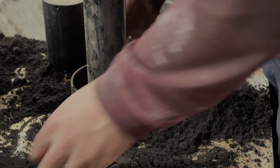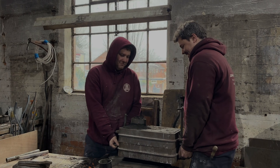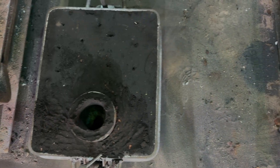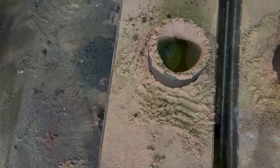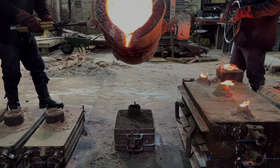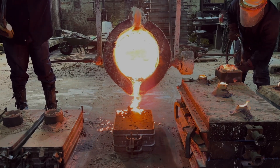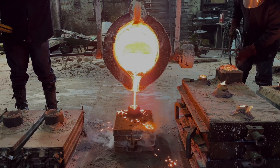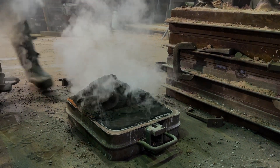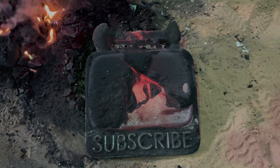It's time for the final touches. Ant creates a bush out of green sand which helps guide the metal into the runner bar, and the mould is brought to the foundry floor ready for an iron cast. So there you have it — get yourself some facing sand, green sand, a few boxes and something to hammer it all down with, and you could mould yourself pretty much anything. It's glowing — it's like the reveal from Iron Man when he makes the mask!